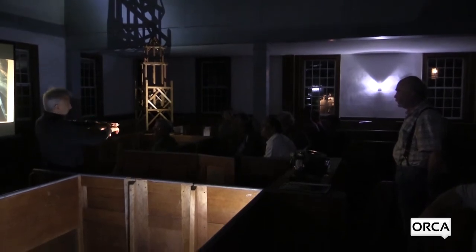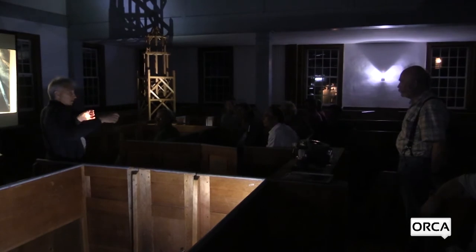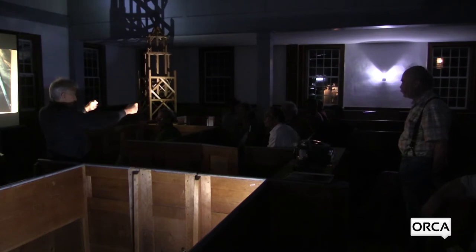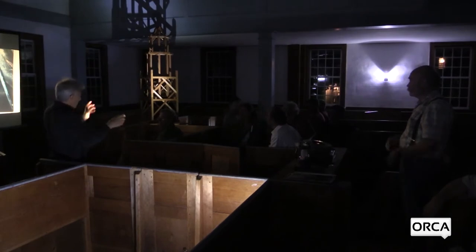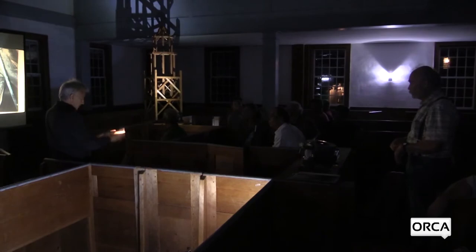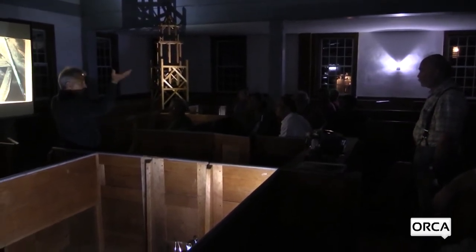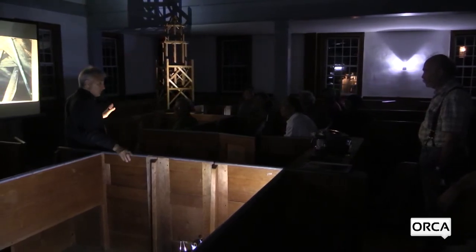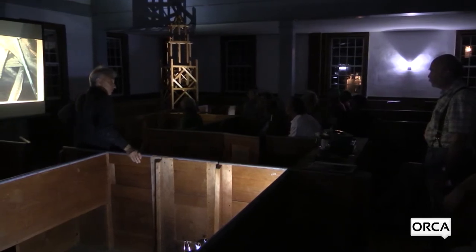I'll build a big frame on the ground made of 28-foot, 26-foot timbers. And I'll have it sitting up a couple of feet on cribbing. The octagon post will come down onto an octagon shape or a square shape, much like those are, that takes the octagon, that you can put an octagon into nonetheless and brace it off. Then the mast will be hanging down there. If we found we needed to work on it more, I'll just jack it up with structural scaffolding there, pick it up by the rigging. But at first, I just leave it there until you guys decide how much money you want to spend, how much progress you want to make.